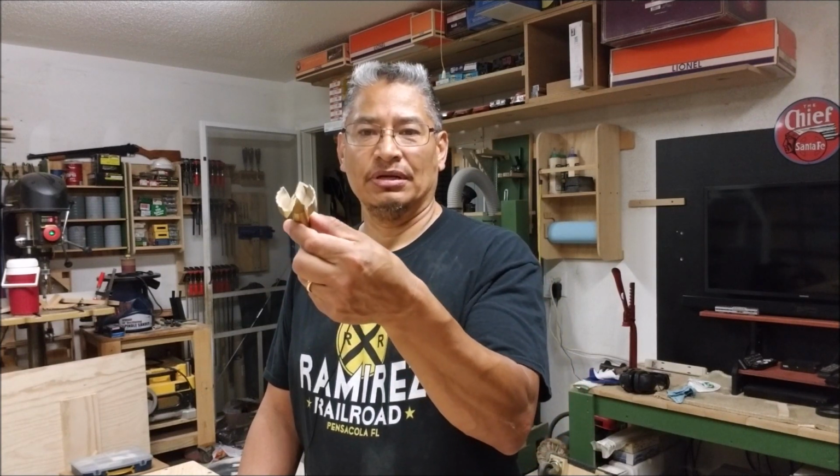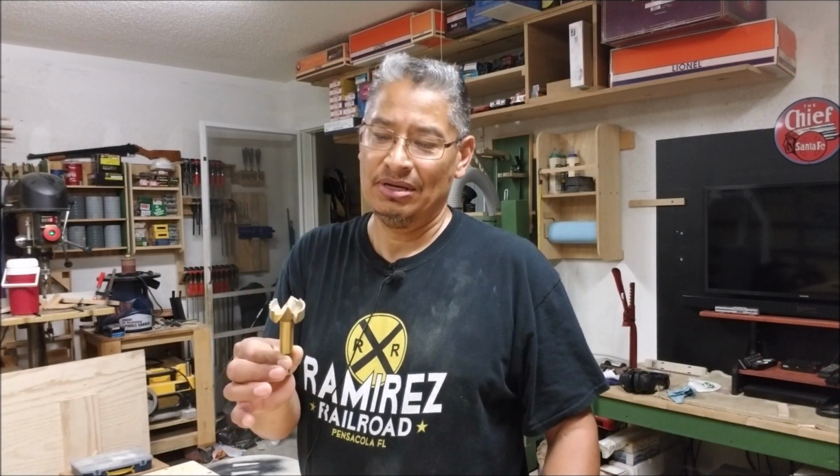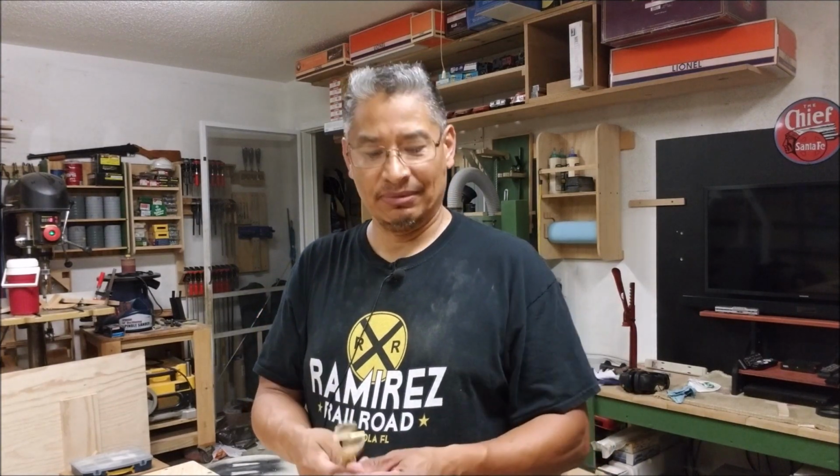Okay. Wire runs. I've seen wire runs get as thick as 2 inches in diameter. You can get them on these larger layouts that have a lot of animation or big, thick wire runs. Okay. Making holes. Good example of a drill bit. This is a Forstner bit. It'll get you a hole up to 3 inches. I've even seen them bigger, but usually they're 3 inches and smaller, clear down to about a quarter, half inch, right around there, and still get an accurate one. You don't have to have these, but they're really great to have. That makes drilling holes very, very easy if you need a large diameter hole.